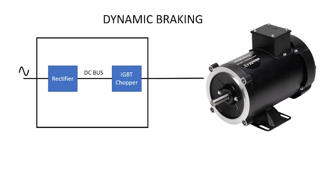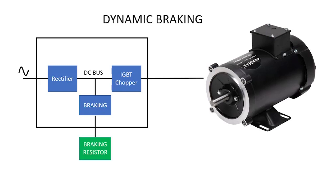The great thing about the GS20 drives is every drive in the family has braking circuitry built in. So all you have to do is add a braking resistor. Now when the motor tries to push too much current into the drive, the GS20 automatically reroutes that current into the braking resistor so the DC bus doesn't rise and destroy the drive.